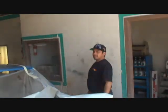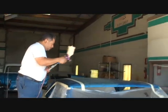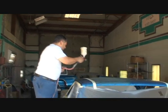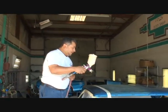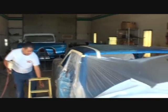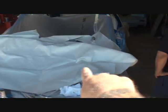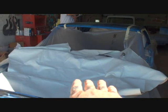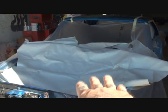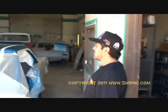You've still got to steam this and put glue on the back side of that, right Ramon? Right. So you're going to get the center on first, then come back and flip it over and do the sides. That's why you're putting the tape down — to line up those seams. Are you going to put glue on the whole top? Just the center. Then once you get the center in, take it off and put both sides on.